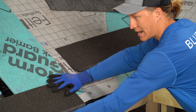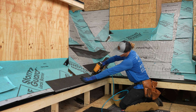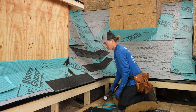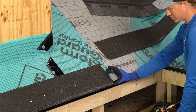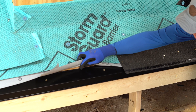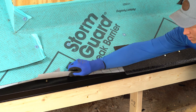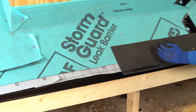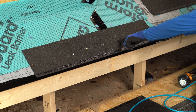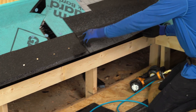You want to hang this past the edge of the gutter apron three-quarters of an inch ideally, and then for fasteners you want to put those about two to three inches up from the bottom. I try to visualize where the top of the gutter apron is and shoot my nails right in line with that. Notice I put gaps right there — those are the gaps where my shingles are going to land. I want to make sure I don't put a nail right here and then have a shingle splice right on the nail.